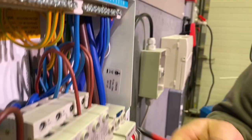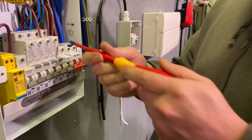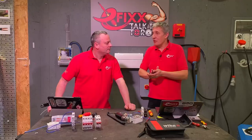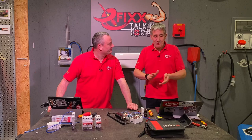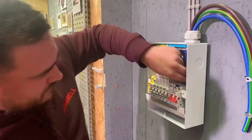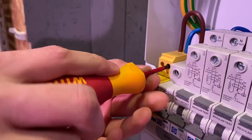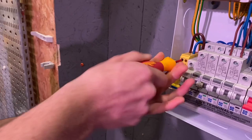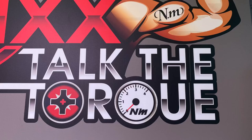Returning to the consumer unit, all contestants were familiar with this equipment. On the main switch in Round Two, the minimum improved to 1.07 Newton meters and the maximum came down to 3.83 Newton meters. Four out of eleven contestants managed to get within the plus-or-minus six percent range. For the SPD at 1.5 Newton meters, the range went from 0.6 up to 2.53 Newton meters, and no one got it exactly right.